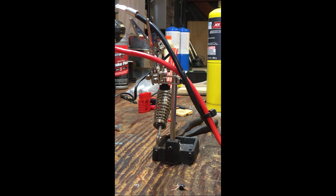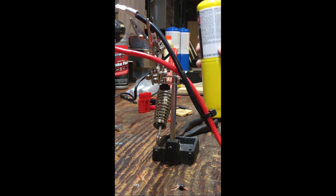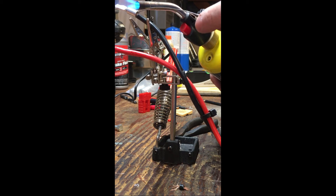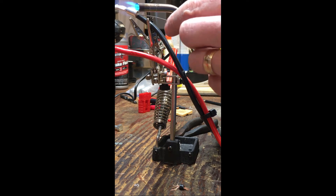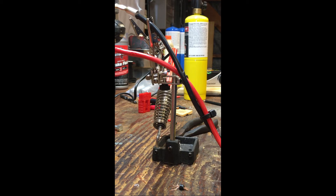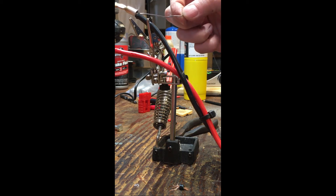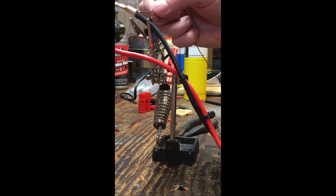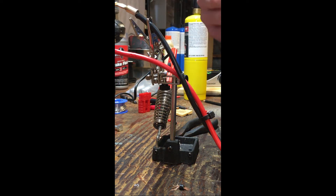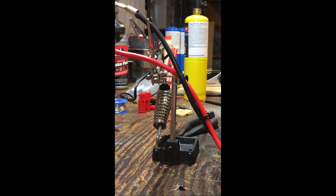When it came time to soldering, my little Weller 40-watt soldering iron did a good job tinning the wires but not doing a good job with these heavy connectors, and I don't have my larger one handy, so we're going to cheat. The beauty of this approach is it gets the connector hot really, really fast, stays hot, and I can actually fill in that little void to get a really good connection. The key — if you know anything about soldering — is you can't move this until that solder dries, otherwise you get a cold solder joint and it's not a good connection.